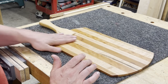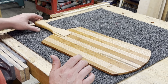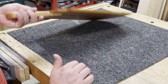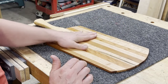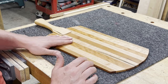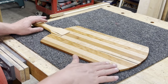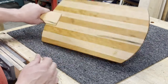Also, well, it's super humid out. It rained hard for like 2 days now after 3 weeks of drought. So who knows if this will change more. It definitely moved a few times. Plus, when you mill it this thin out of that material, I mean, there's some tensions in there. So the milling, I straightened it out with a hand plane as best I could, and then the handle, yeah. So it was a process.